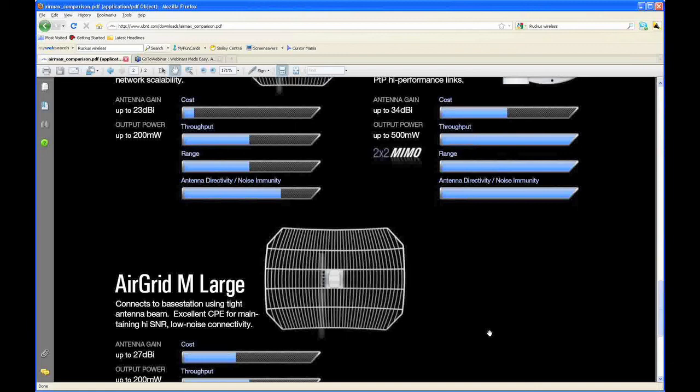From there, you also need to run an Ethernet surge suppression device in line. In the U.S., it's pretty much mandatory to run those devices on the outside of buildings. But you run that shielded cable. It's grounded to the POE. You have the Ethernet surge suppression in there. In most cases, that's going to provide enough protection for your links. In certain parts of the country, you need to take the grounding methods even further with additional ground wires and that type of thing.